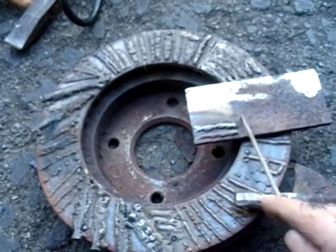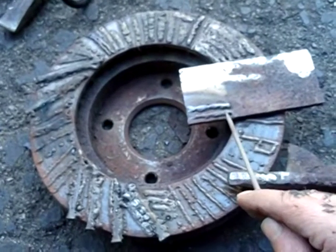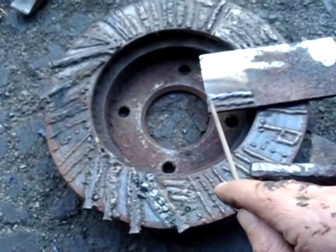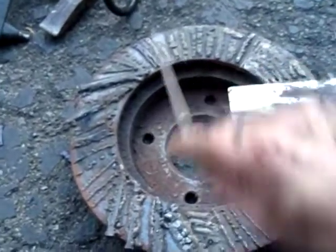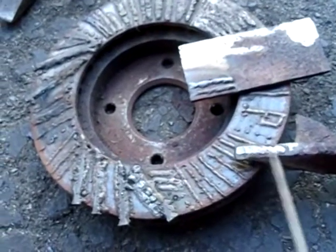That must have something to do with the fact that it's cast iron. On carbon steel there's no undercut with these same settings — I went from here to here, so the metal had to get pretty hot by the end, and it still didn't undercut. I think the cast iron is softer and more delicate. But like I said, you can use it for practice.